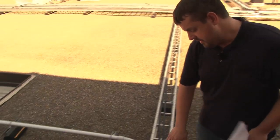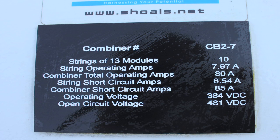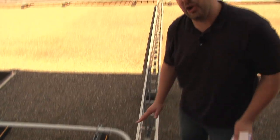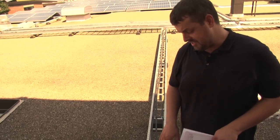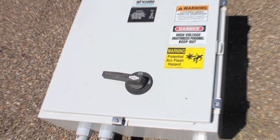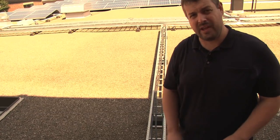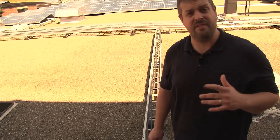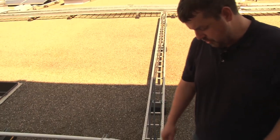Let's take a look at the box. Down at the box we can see they put a label on here that says there's 13 strings of 10 modules and they've given us the operating characteristics. The operating characteristics are not a code requirement, but what is a requirement is that we identify this box — what it is, what it's doing. It has an integrated switch; this is a 2011 code issue. When this box is located remote of the inverter, we need to have a switch on here. That's great code compliance.